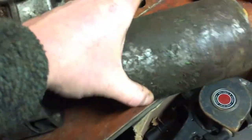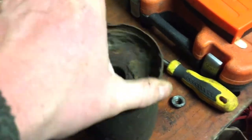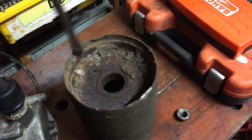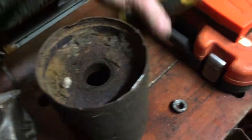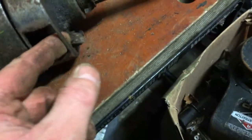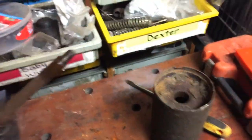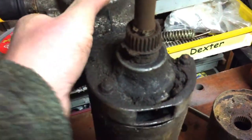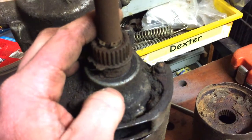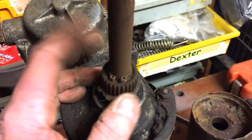I needed two hands to get it off. In there it's not really dirty but you can see the dirt in there — there's a stone in there as well. That's the sort of thing that will cause these drives to fail. There were little bits of muck in there even before I got it off. What happens is them stones and grit can get caught up behind that seal and it will start to leak, and then the oil will come out and your drive will start to fail.